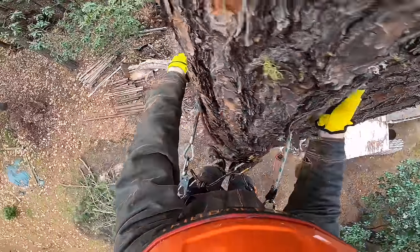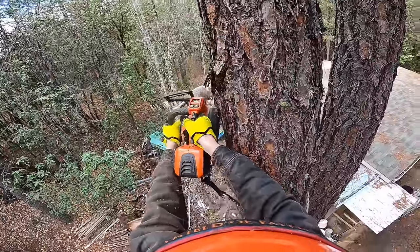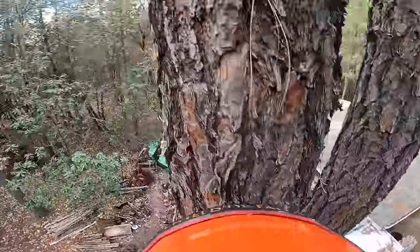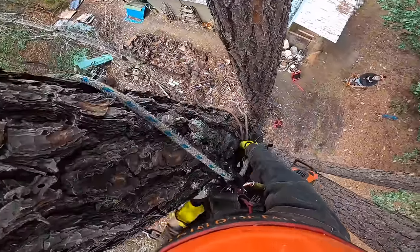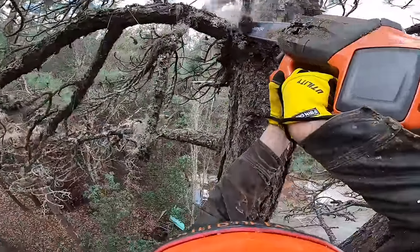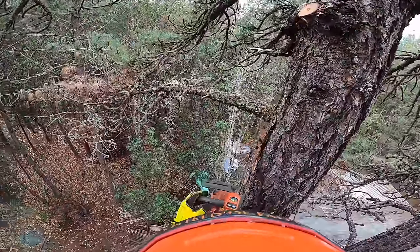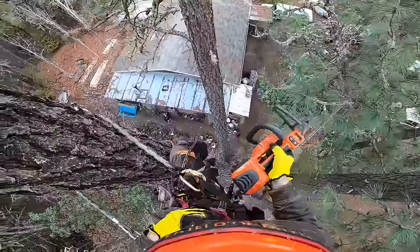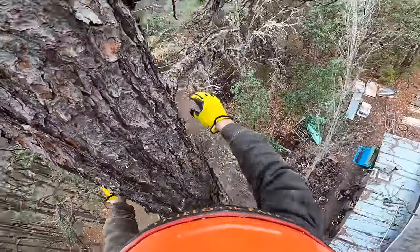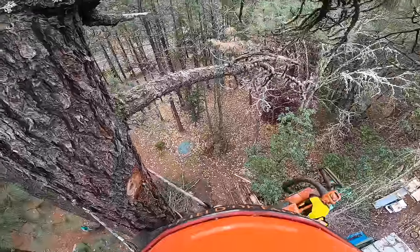Okay, tied in twice. Evan's watching so I'm going to use two hands — chain brake between cuts. I like to manipulate these pieces with one hand and cut with the other; I get a lot more control of where they go that way. But since I'm trying to model two-handedness right now, I'm going to do it differently.